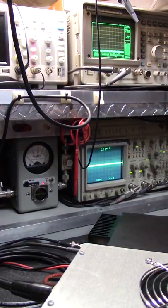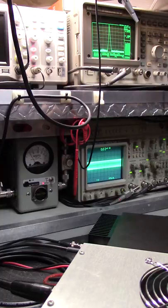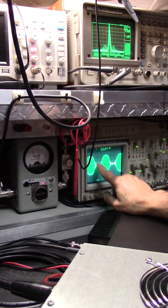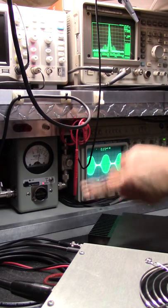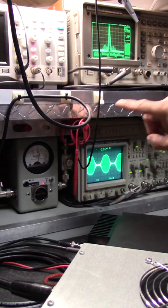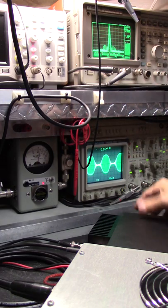Okay. It's on. Power to where it's about 100. Looks all dirty, causing all kinds of spurious emissions. What happens to the negative peaks? It's because it's conducting 90 degrees. It's not doing a whole cycle, okay? It's only conducting about 90. Where's the rest? Well, right there.